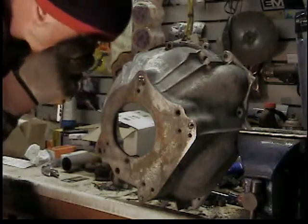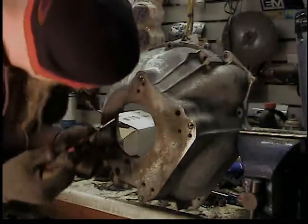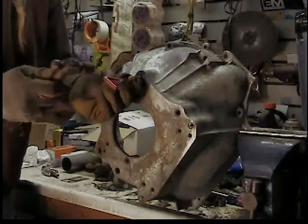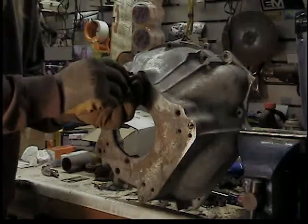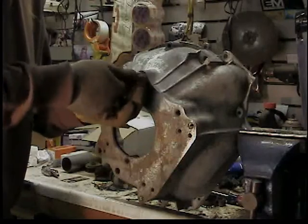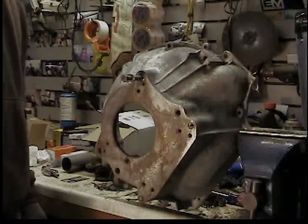Back out the insertion tool, and then we've got to knock that tang off, because your bolt might want to go in deeper where that tang is. I'm using a smaller insertion tool from a different helicoil set and just tapping it with a hammer — it breaks right off, it's kind of designed to break right off. Then you're putting a bolt in just to test it — much tighter than it was.